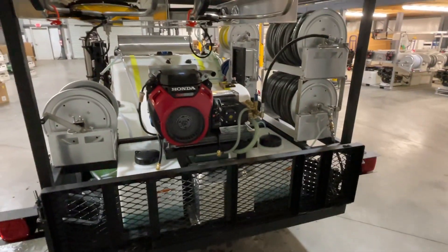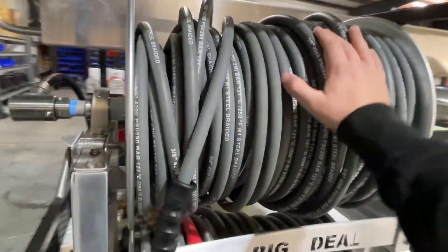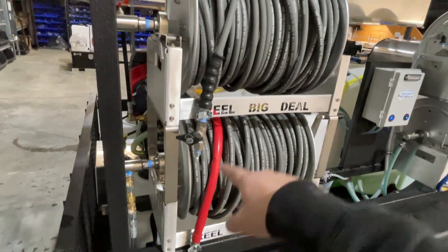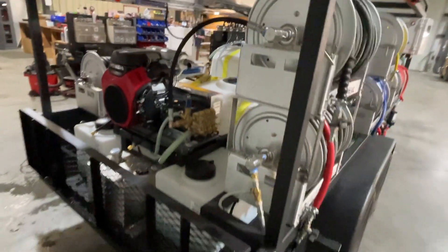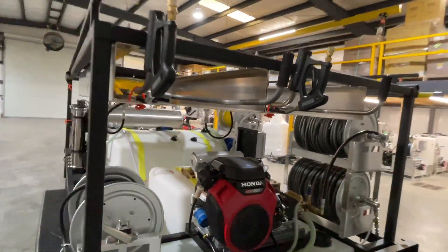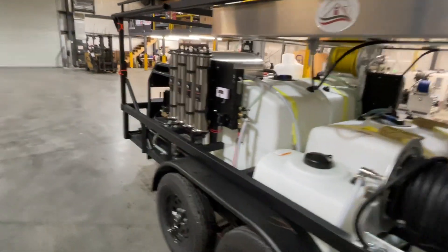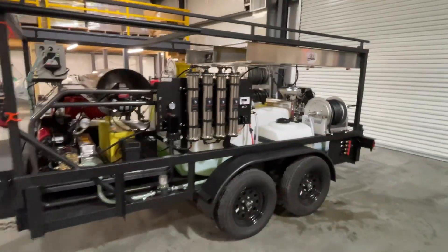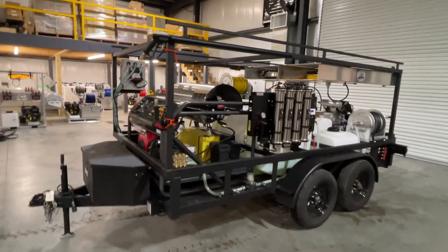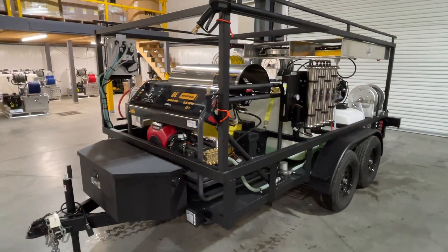He's got his auxiliary chem tanks in the back and these are siamese, so he'll probably put degreasers or something in those for downstream and off of this upper reel. This one is a hot water unit with the red indicator; the upper one is going to be coming off of this other unit. So he's got two eight-gallon-a-minute machines on this thing. Bleach tank and all that stuff is pretty standard. He's got two surface cleaners up here in these racks, which are really nice — up and out of the way. Window cleaning system on the side. Very functional trailer — this trailer can pretty much do anything in the world you want to clean: pure water window cleaning, degreasing, hot water, cold water, soft wash capabilities. If it's dirty, we can clean it.